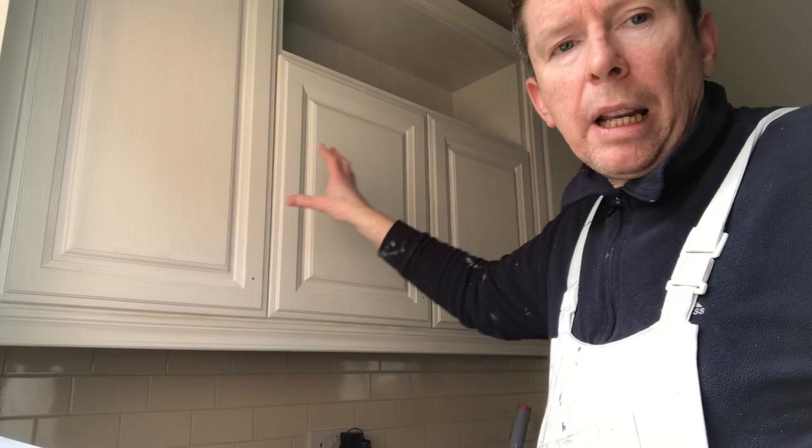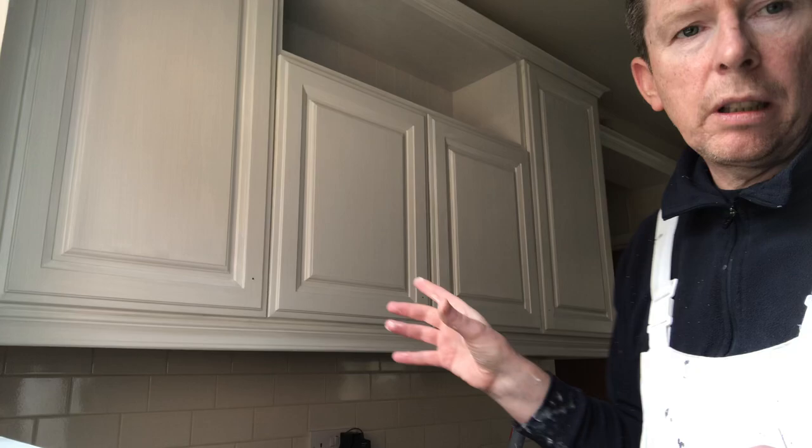Very important — I'm going to put two coats of primer on. Take your time and basically that's it. This area here has two primers and one finished coat. It's a Colour Trend colour, very light, a light grey. As you can see it's very nice. Now what I'm going to do is just show you the whole kitchen here, what I have done so far.